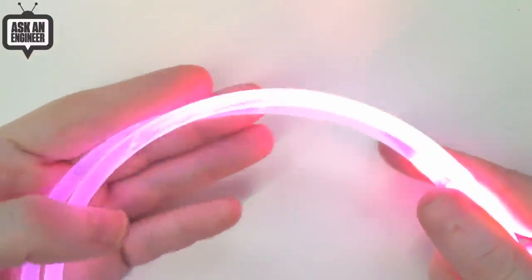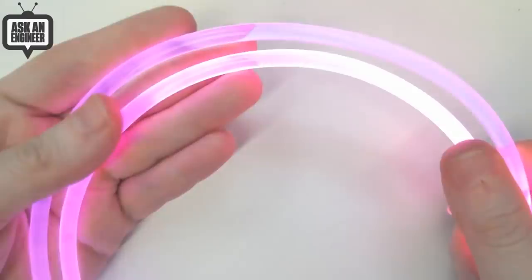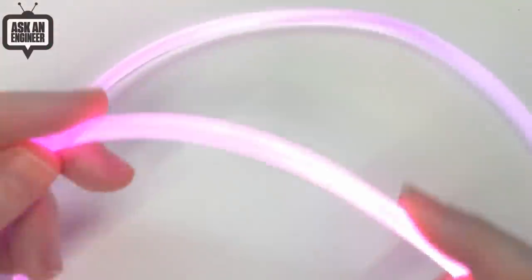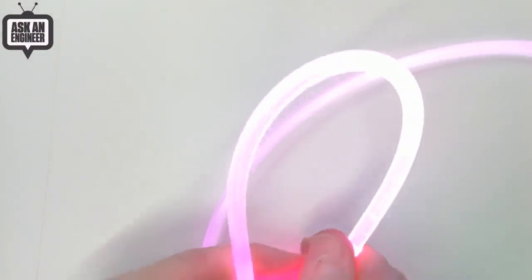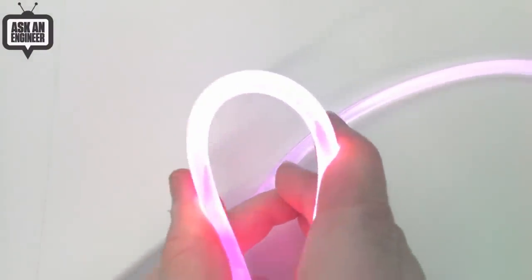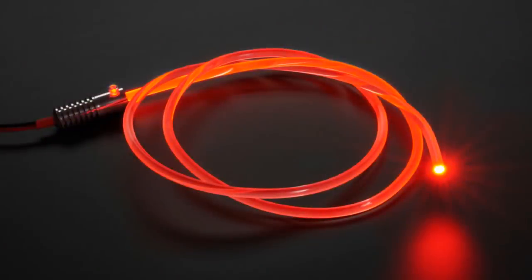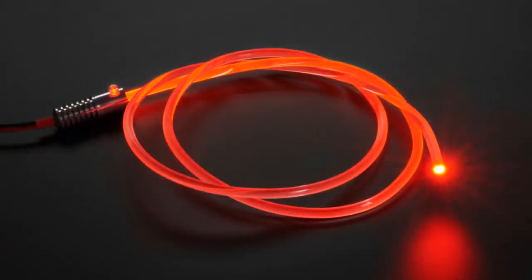It's a little different than EL — there are other restrictions. Nothing's perfect. This is translucent and we're selling it in four millimeter and five millimeter, which works best with the emitters we have. The nice thing is it's flexible, though not as flexible as EL wire which is bendable and stays bent. With this you'd actually have to sew it to keep it in place. You can bend it some, but eventually it might crack because it is plastic. So we have some other colors, and the tubing is clear — the emitters control the color.